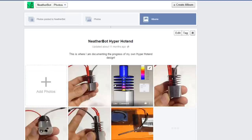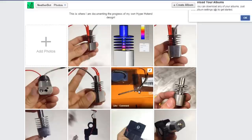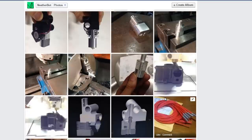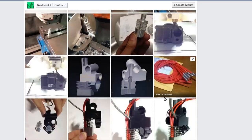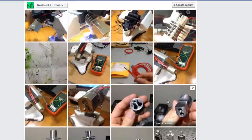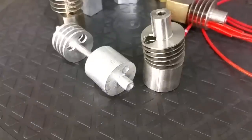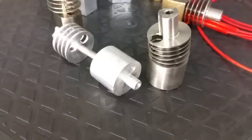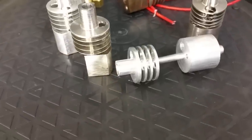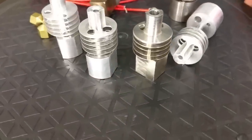Not knowing much about the actual science behind a hot end, I experimented to figure things out. I started by running a steady state thermal analysis and tried to remove as much weight as possible while still having a proper thermal profile. Then I started to make my prototype hyper hot end out of stainless steel on a manual engine lathe and mill. After cranking out some prototypes that worked reasonably well, I started to contact local machine shops to see what the cost of a production run would be. They came back with quotes from anywhere between $800 and $1,200 for a single hot end. This is where things begin to fall apart. Stainless steel has great thermal attributes over aluminum, but the cost and manufacturability of stainless is atrocious. So I already lost the battle of keeping costs down big time.